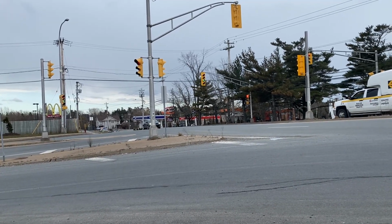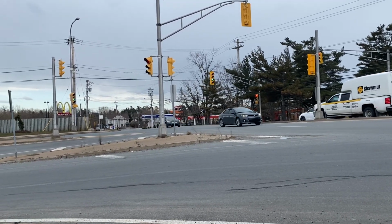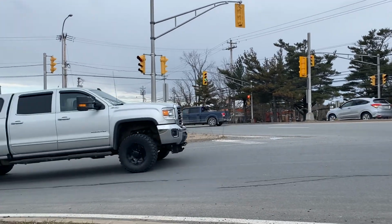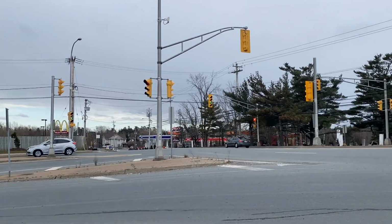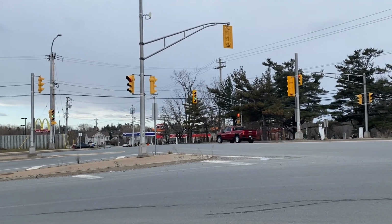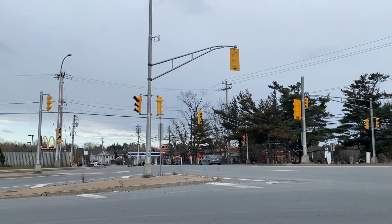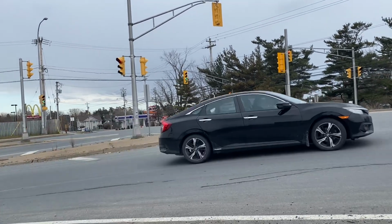So now we'll just kind of rest in 2 and 6. So, yeah, the side street here in both directions is phase 4. This direction that we're looking at now is technically overlap A, because this can stay green with phase 8. Similarly, 2 can also stay green with phase 8. They're 2 separate intersections and they are compatible phases.